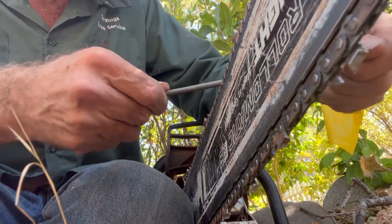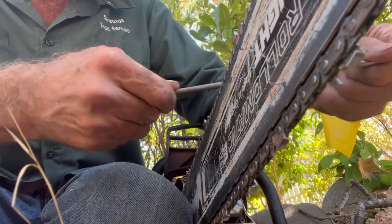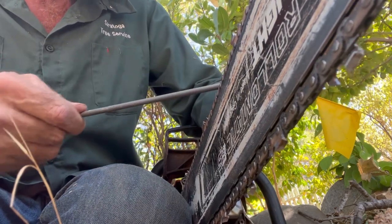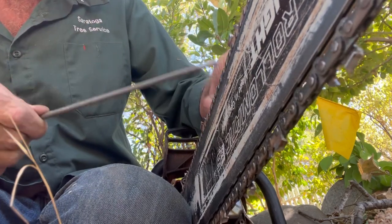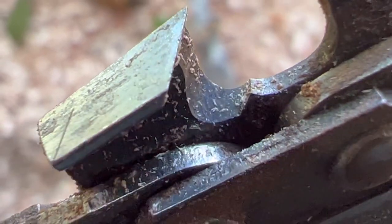It's very important that you have the saw stable and you're managing the file with both hands, because the first motion is pushing down and the second motion is pulling back in to create the curve. And the last motion is establishing that top edge, the very sharp edge. So you have to reestablish the opening.